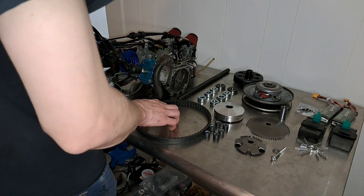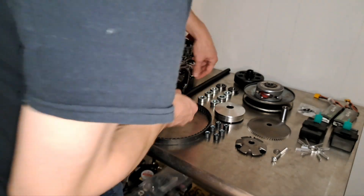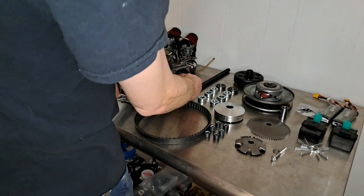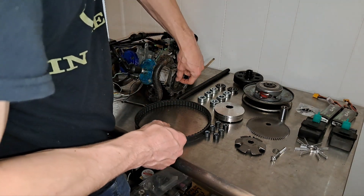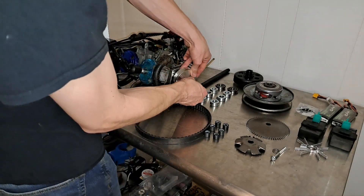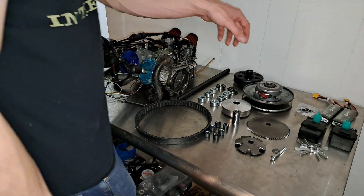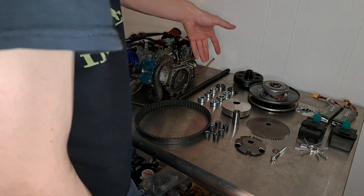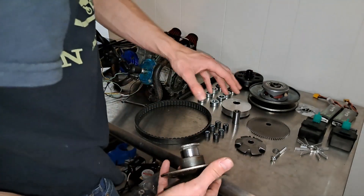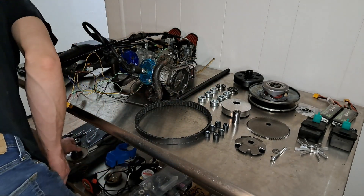To sort of explain what my plan is: I'm using another clutch center because I used two of these clutch pieces to connect the crankshafts of these separate engines together, timed 180 degrees apart. We're going to adapt this variator from a scooter onto this engine. That will give us basically the same thing as a torque converter — like your minibike or go-kart torque converter — and we're going to be using the rear pulley off of that and a jackshaft, because normally on the rear pulley of a scooter the clutch is built in.